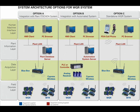On the other end of the spectrum is Option A on the left hand side, for customers who have their own automation system and are happy with it — their users are trained on it and have existing displays and data points. In this case, the wireless gauge readers and transducer readers send information to the blue box, which is connected to the intranet and exposes the data through OPC for industrial automation, BACnet for building automation, or SECS-GEM for semiconductor applications. The data integrates into the existing plant automation system just like any other point, cost-effectively and wirelessly, and can be managed using existing tools and human-machine interfaces.